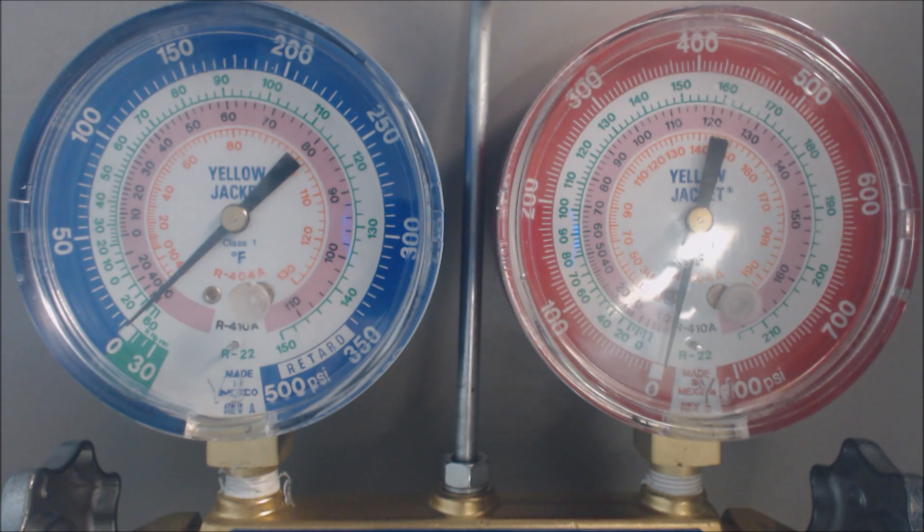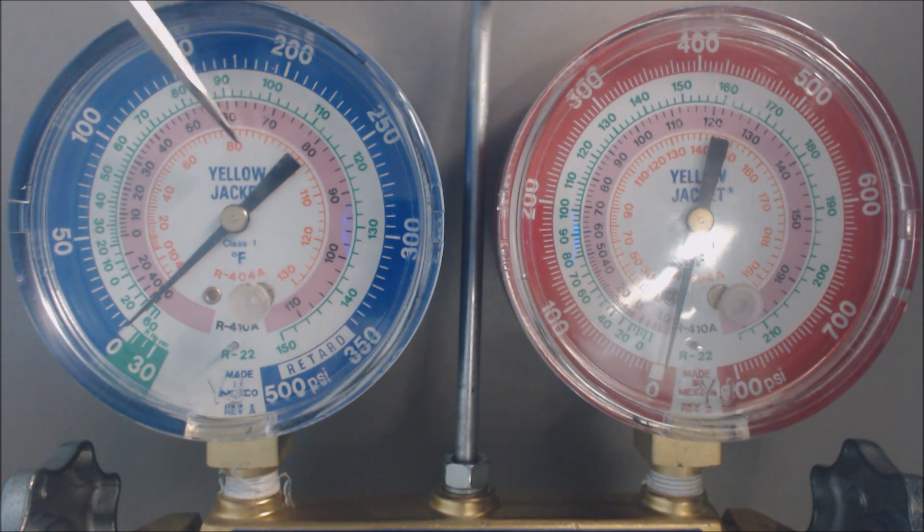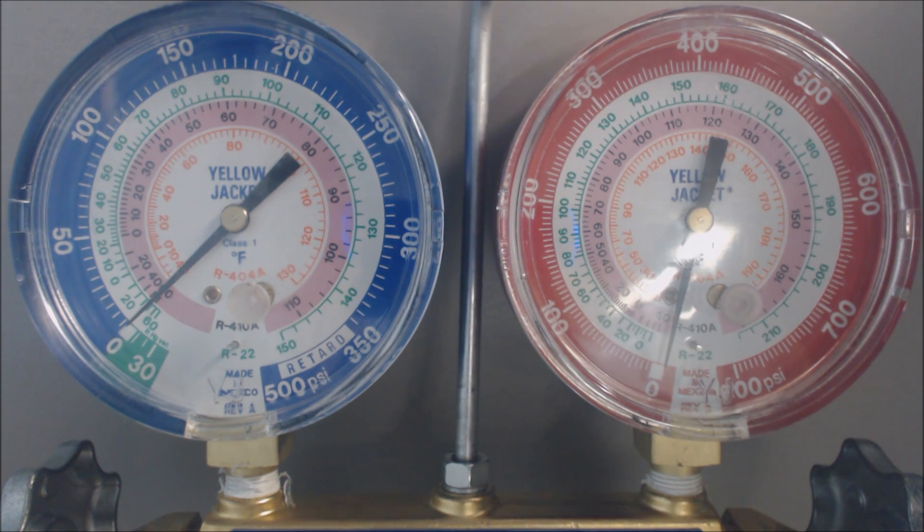83 psig corresponds to very hot and humid conditions inside the house, since this has to do with the evaporator coil. If the pressure is down at say 60 psig but the refrigerant charge is correct, it could be that the house is already down to 63–65 degrees inside — that's a reason why the pressure is lower. You want a load on the house: warm outside around 70 degrees, inside around 70 degrees, in order to properly check the pressure.